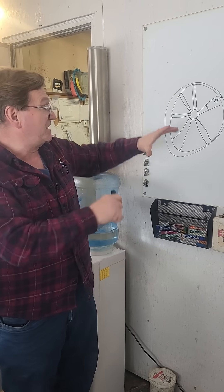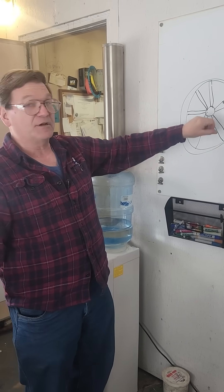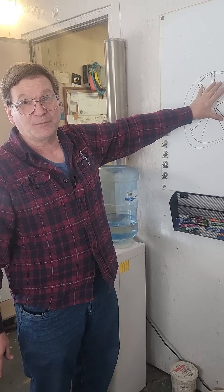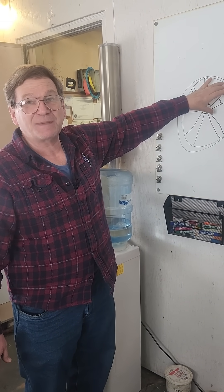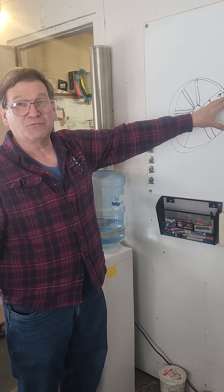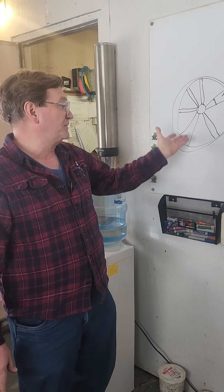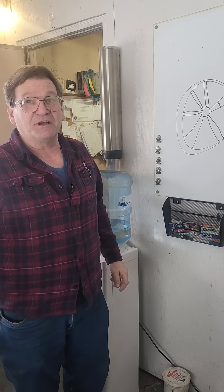Now, if you had a furnace big enough to put your whole pulley in, you can do that. If you slowly heat it up, then you can come in here and braze it like anything else. Let's say all of this is at 1200 degrees — we go to the upper end — and we're brazing at 1400. We don't have much expansion compared to the rest of the metal. But if the outer rim is at 80 degrees on a warm day and we heat the spoke to 1400, we've got a lot of expansion and things are going to break. That's why you heat it up and cool it down slow, so everything has a chance to move without a sudden jolt that causes it to fracture.